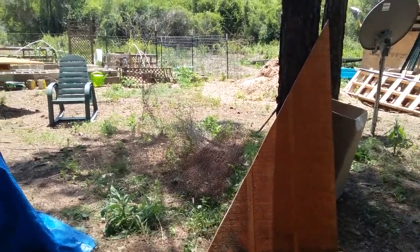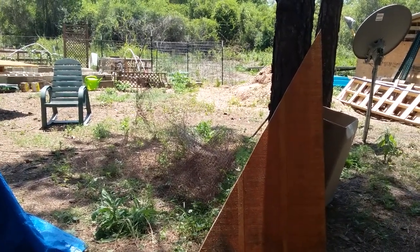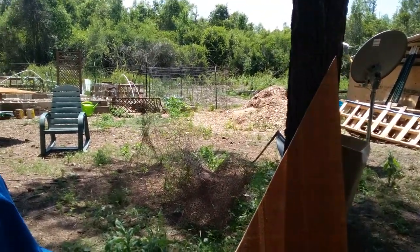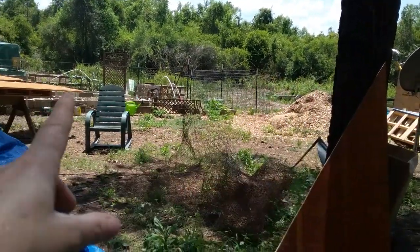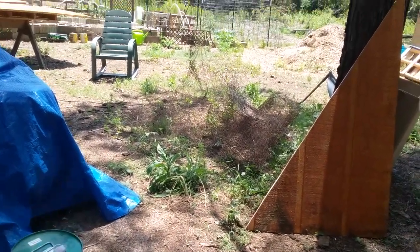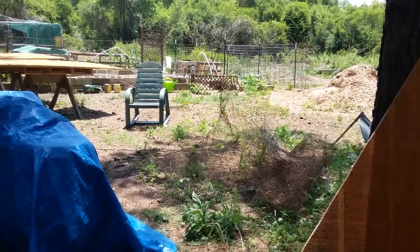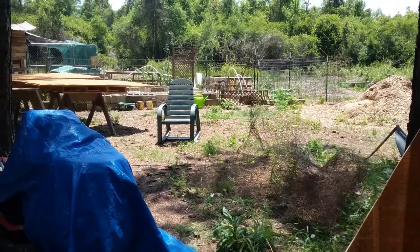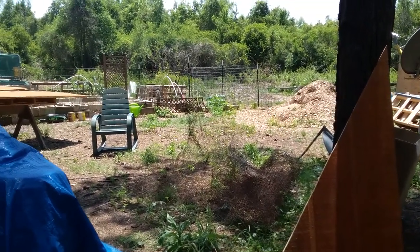Monday, we are talking to the well driller. We've already talked once on the phone. And what they're telling us is they think a 100-foot well for us is going to be the best because we're in wetlands, which all back here is wetlands. Our water table, guys, if you dig down 4 feet, you're going to hit water. So the water table here is very high, and he says a 100-foot well will serve us very well. And basically he's saying they'll drill until they get the type of head pressure they're looking for.